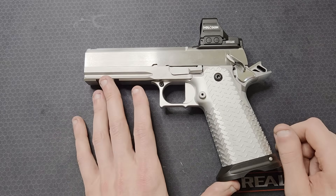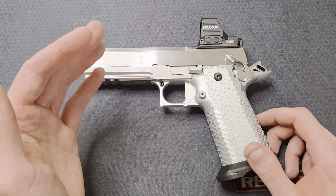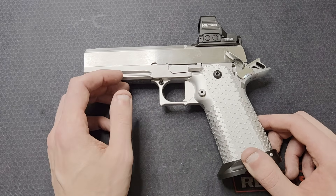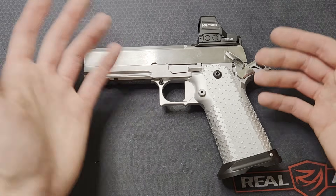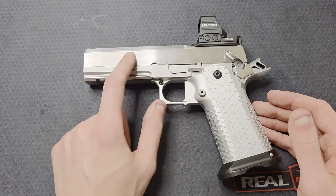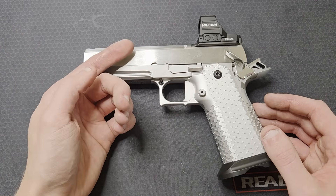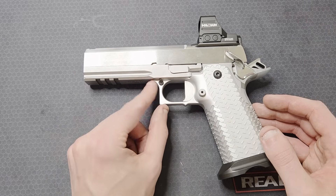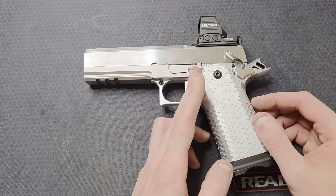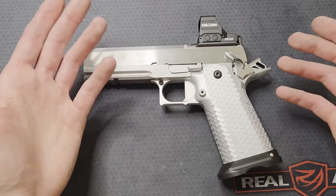I was kind of second-guessing myself through this whole process. I haven't seen people really talk about removing material from the slide barrel passage before when fitting a barrel. Why am I having to do this? Should I be doing this? What did I miss? It strikes me as a bit odd that the Atlas slide would need to be clearanced this much for an Atlas barrel. But then again, I'm using a Chile frame. Maybe the Atlas frames have a vertical impact surface that is further forward and they prioritize short links and minimum link-down distance. Who knows?